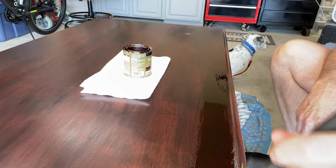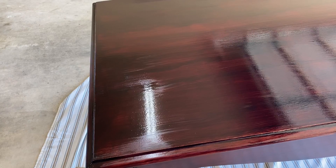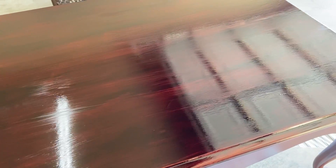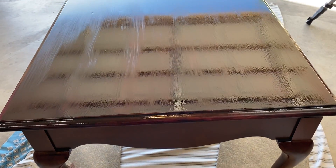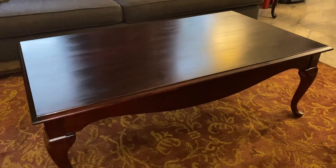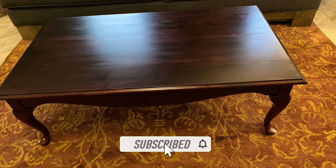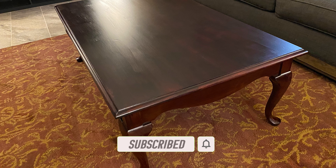It's all scuffed up but it needs to be that way for the final coat of stain and poly to really make it look good. After applying one more coat, I left it alone in the very hot garage overnight, and this is what I came back to - it looks super nice. I am so happy with this project. After a few days it has the chance to cure and harden even more, and it doesn't smell as strong either, so you might want to wait a few days before putting it back in your home. The product is Minwax PolyShades - stain and poly all in one. I hope you enjoyed this video - please like and subscribe and check out my other DIY projects on my DIY playlist.